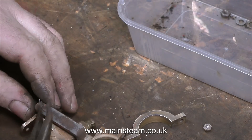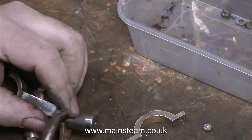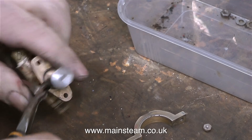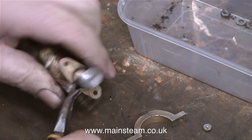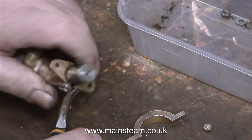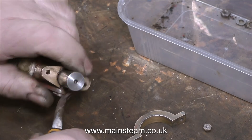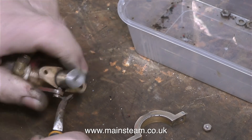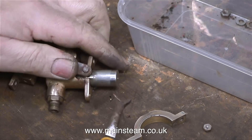If you analyse why this pump has been made this way, you will see that if it wasn't made this way, and it was just a standard pump fitted in such a confined space, the eccentric rod would have to be far too short, and this would put side pressure on the pump ram, and premature wear would occur. I've worked on quite a few Stuart 5A stationary engines over the years, and these use a crankshaft driven pump with a very short eccentric rod, and the main pump ram is normally worn just on one side, and the side of the ram that gets worn is very relative to the direction of rotation of the crankshaft.